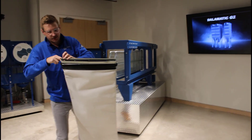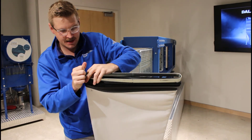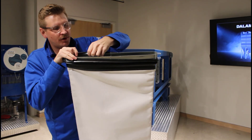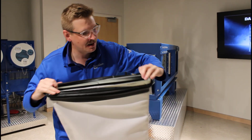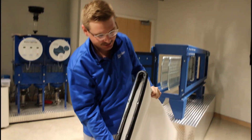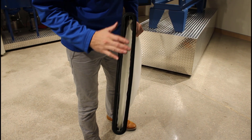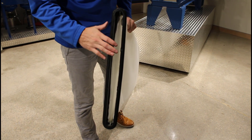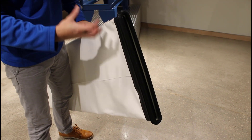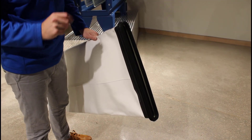This gasket has a little ring on the top of it, so we're going to start by looping this over — you can see how it's getting seated right over the top. Now we've got a fully seated gasket — it's a nice flat part. You've got some tabs on the production units that are going to align with your tube sheet and make sure that you get a good seal. You also have multiple wipers on this radial seal, creating that nice tight seal for an airtight, dust-tight design of your collector.